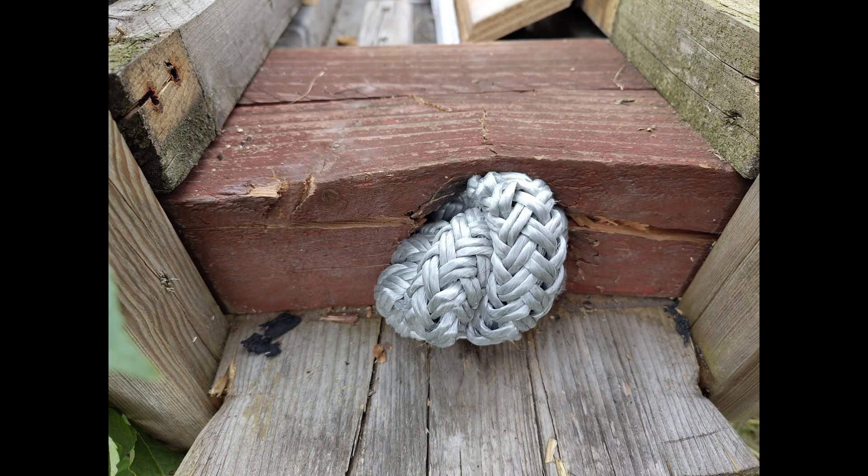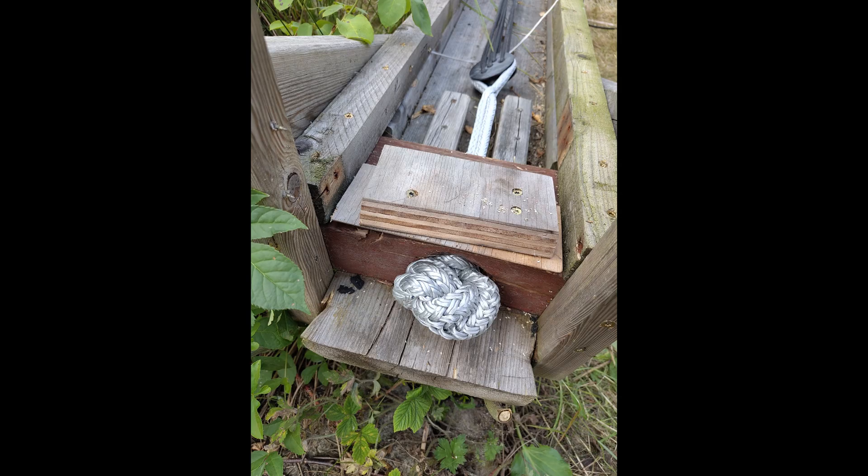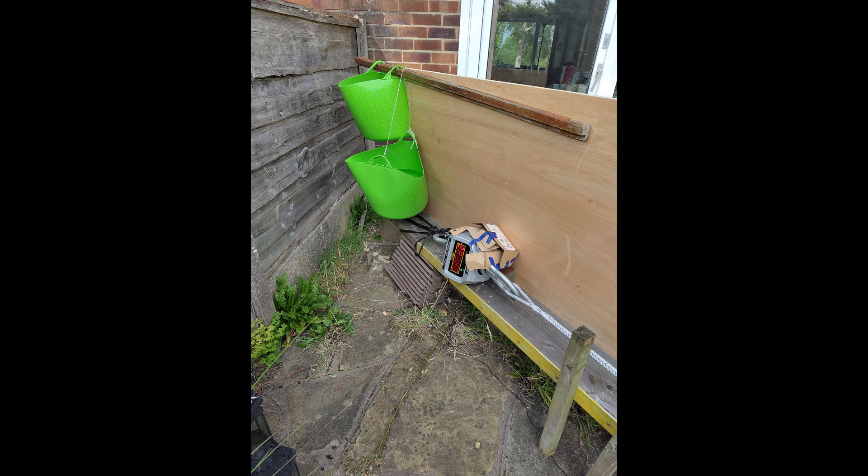You can see here how our chain plate knots both tightened up but also started to pull themselves through eight inches of old gate post — they split it, cracked it up and made a big hole in the middle. I did some patching up with some plywood screwed on top, which held it together enough for us to finish the job. We also did all the strengthening of the other end to stop the plank lifting up as the pressure was put on it, and this worked well. In the end we were able to stretch all the shrouds and all the chain plate loops to 1,500 kilograms, which we feel is at least adequate to get the mast up.